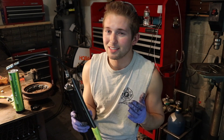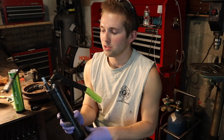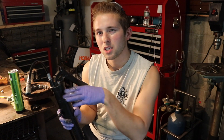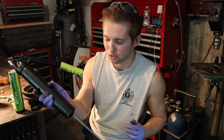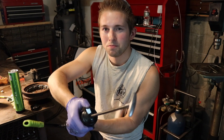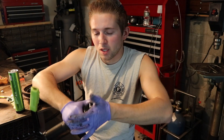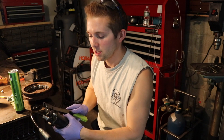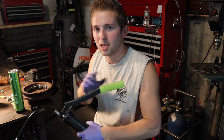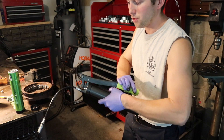If you're doing this in winter, it's a good idea to bring the gun inside after you change it because it's going to be really difficult to prime. On more fancy grease guns there's a little air bleeder valve — mine is just a screw, which I could replace with a proper bleeder, but I'm going to try just keeping it cracked a little bit to get the air out. Push the tab back in carefully since it's spring-loaded, slide it back in, start squeezing. Come back and tighten down the handle and with any luck we'll have all the air primed out. And we're getting fresh grease — we are good to go.